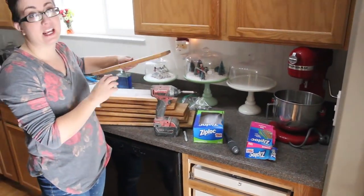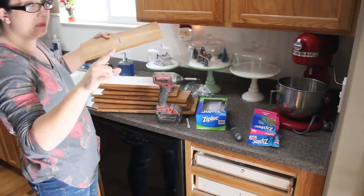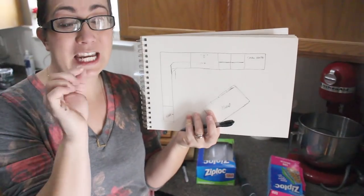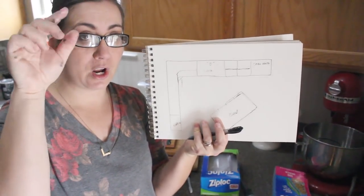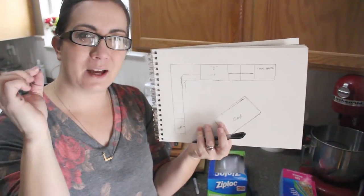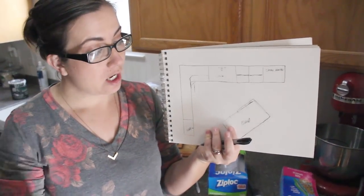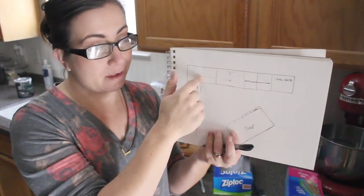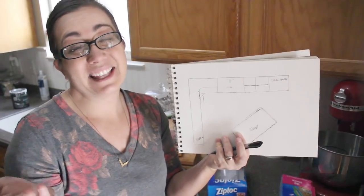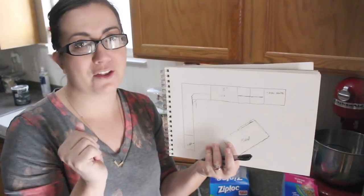The most important thing is to stay organized. I have numbered all of my drawers and I'm going to do the same thing with my cabinets. I'll number the individual cabinet doors where the hinges go, because that won't be seen. But I can't number the bases, so Zeb drew a map. As I number each door, I'll put the corresponding number on the map, and when we go to put them all back together, it'll be easy. This is really important so everything goes back together the right way.